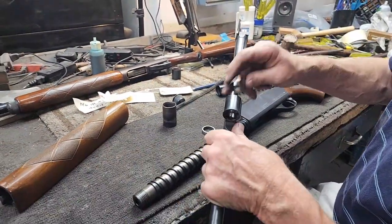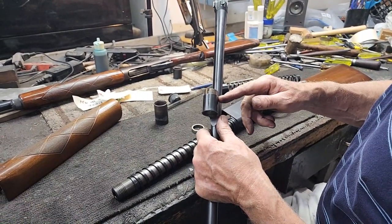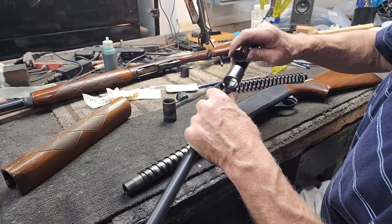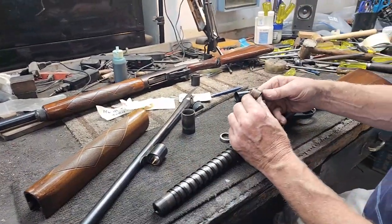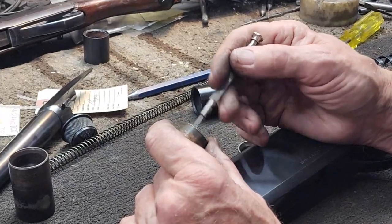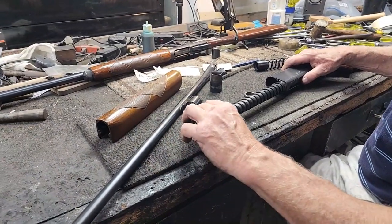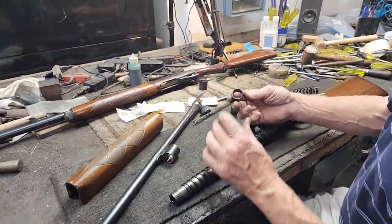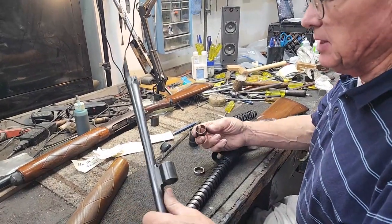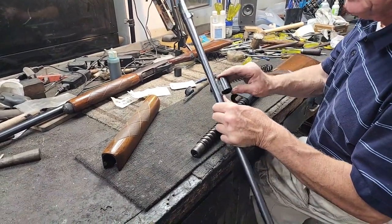There's a piece in your barrel - it sticks in your barrel. I haven't made these up yet but we're in the process. These pieces can get lost but they're not likely to because they stick in a barrel ring - this is called a friction piece. I thought they were solid copper or bronze but on closer examination, after we ground on this a little bit, they're actually steel with a heavy copper plating on them. That copper slides on your magazine tube instead of the bare steel. We're in the process of making those up - it's a little tricky because we've got to find somebody that can put a heavy copper plating on them. These don't go bad very often, but it should stick in your barrel like so and not come out.